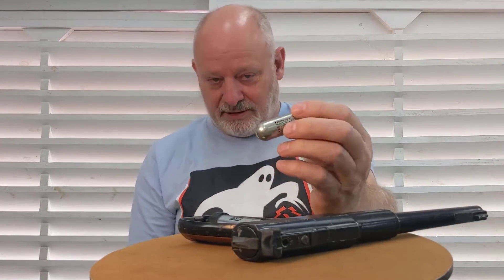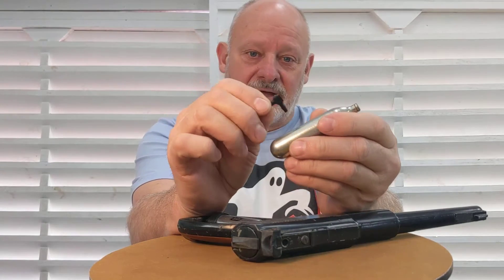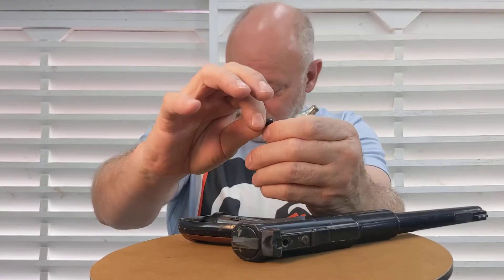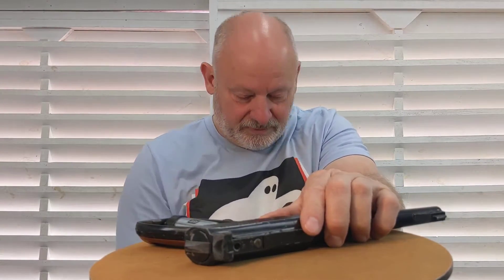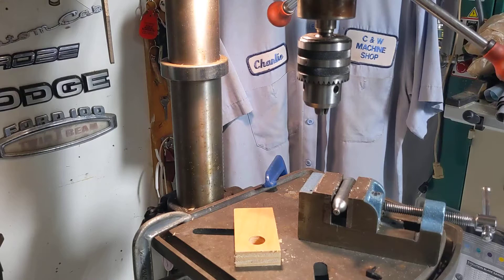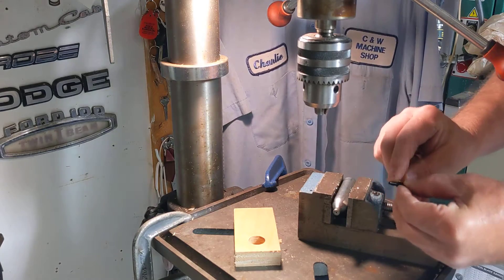So I'm going to take a cylinder like this — there's a spent, empty one — and I've got this 90-degree plug here. I'm going to drill a hole in the side and epoxy that into the body of the CO2 canister, and then I can have an airline hose run to this regulator and hook that up to my air compressor. I can just dial the pressure to whatever I want, pressurize the gun, and begin to determine where the leak is coming from. I'm going to take it to the drill press now and mount that little piece on there.